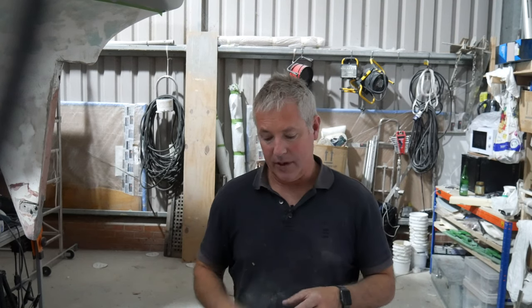I'll go out with this last piece of footage. I'm just about to get up on deck and get the orbital sander out finally to just knock back that last bit of primer. I've spent the last 4 days doing all of the radiuses and corners and bits that you can't get the sander onto by hand, just with 320 and 400 paper, and it's been so boring. But the next part, getting the orbital sander out, is just going to rip through probably in about 5 or 6 hours. So I've sort of been promising myself this little bit of joy after days and days and days of hand sanding.